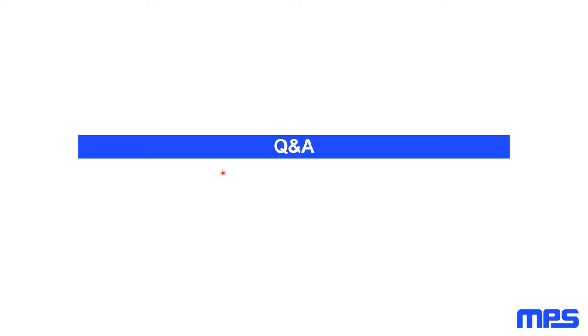A cheap probe to find RFI. It's easy. It's not part of that webinar. You can look into our old webinars. One of our first webinars we did from MPS was exactly that. There the engineer just used an MLCC output cap, which was soldered to a BNC cable. So just check our first EMI webinars. There you will find it. You will see how to use an MLCC with a specific size on a BNC cable to look for EMI.